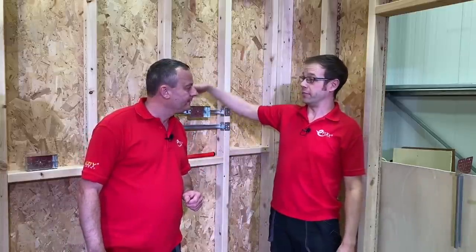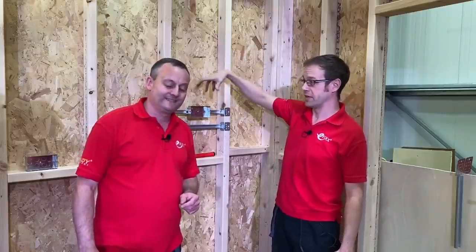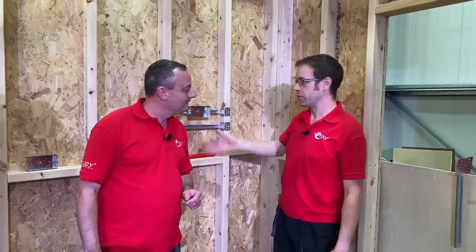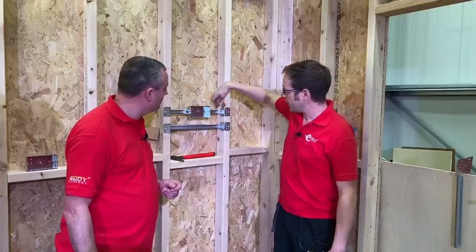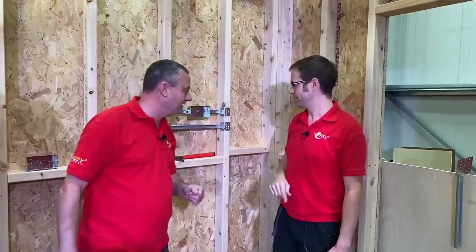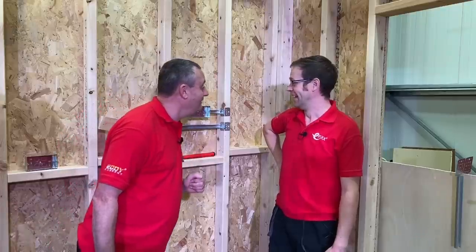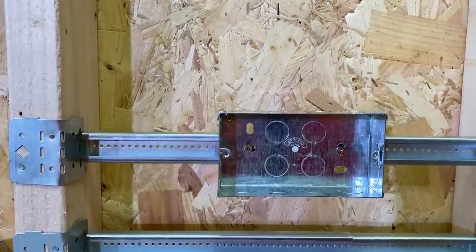This has been designed with other uses too — you could fit it for installing pipework, or to support conduits dropping down inside the wall. It's a great solution for fixing conduit in the centre of a wall drop between studs. Also worth noting: you don't have to bend the flap in the direction we did — you can bend it the other way, giving you slightly different mounting depth options, especially when fitting pipes of different sizes. We always like products at eFix that save electricians time, and that is the Walraven Rapid Sliding Wall Bracket — it absolutely is going to save electricians time, and we like that at eFix.